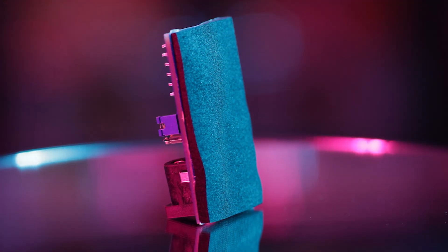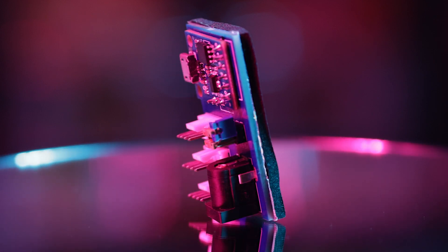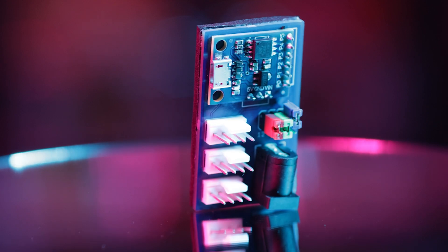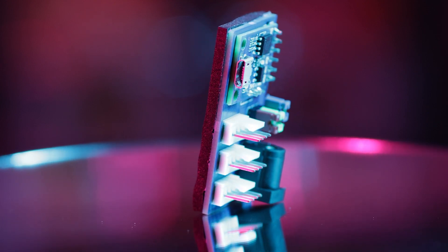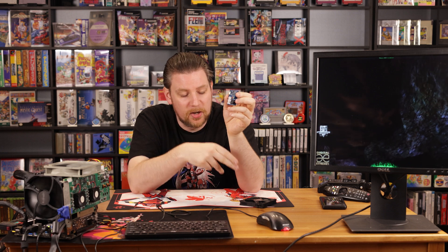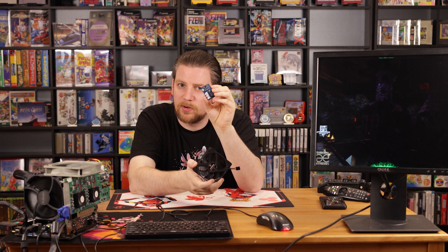The microcontroller on this DigiSpark board is an AT-Tiny85, which is designed to run at five volts — but we have 12 volts coming into the board, which would just make that chip blow up. Luckily, this board also has a voltage regulator that takes the 12 volts in and spits five volts out to the microcontroller. That also means whatever voltage the microcontroller runs at is the voltage on its digital signal pins — including the PWM pin going to the fan. The fan expects five-volt signaling on its PWM wire, and this outputs a five-volt signal. It's almost like these were meant to go together — I didn't need any extra components to make it all work.